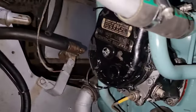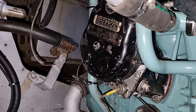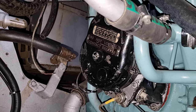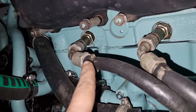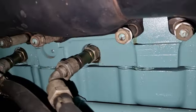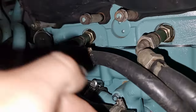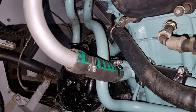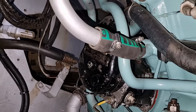While we are down here, we've got one of the magnetos for the main engine — pretty simple stuff. They have two of them. It's a 24 spark plug system — each cylinder has two spark plugs. This one is what we call the exhaust side magneto because they are under the exhaust. And then you have the inlet side, which are on the valley of the engine itself. So this has a twin that goes on the other side. The magnetos are offset by about five degrees to give you a full burn, and it also gives you much better power at higher revolutions.